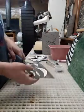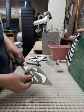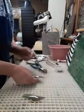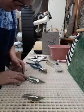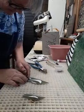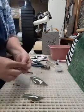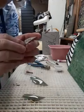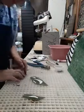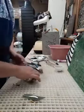You'll notice I laid the pattern pieces out so that I went right straight from here straight through to that one. So I can use the advantage of one stroke cutting, for lack of a better word, to save time. Again, I overshoot the corner so that I can grind that exact. That way you won't have a bunch of corners missing, or points. Points are the hardest.